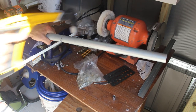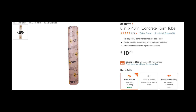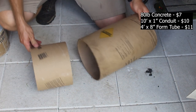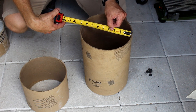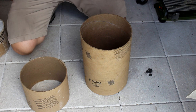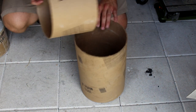If you don't have a hacksaw or something to cut the conduit with, you can buy iron pipe in various lengths, but that is going to cost you a lot more. The concrete form tubes I'm using are 8 inch tubes, but not all 8 inch tubes are created equal. These are the same SKU number off the same shelf from the same store, and one measures under 8 inches in diameter and the other is just under 8.5 inches in diameter. This will throw your math off a little bit, so I recommend taking a tape measure into the store with you when you go to buy these.